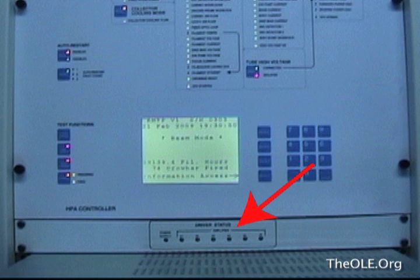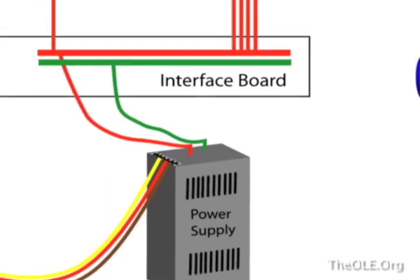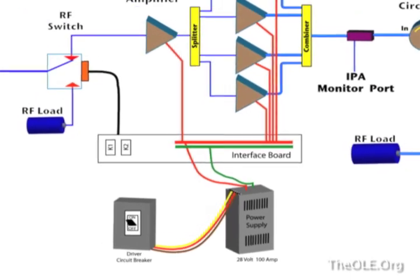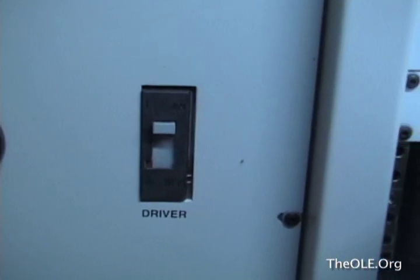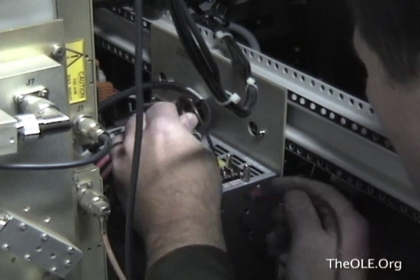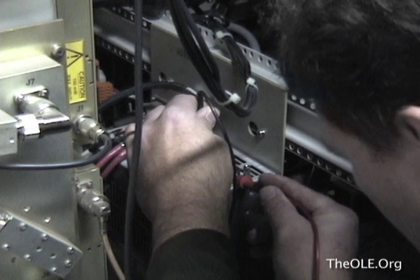But after all these simple things have been tested — namely the switch — something else catches the engineer's eye. These lights are all out. This is what indicates that the IPAs are functioning, but without the lights on, it shows they are not. Which leads the engineer to the power supply that feeds the IPAs. The IPA power supply is fed from a circuit breaker, and the first step is to check that. But it is found to be in the on position and not tripped. Checking the power supply itself, it is found that it is supplied with 208 three-phase power. Therefore, the power supply itself is at fault and needs to be changed.